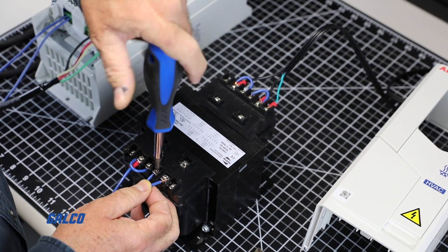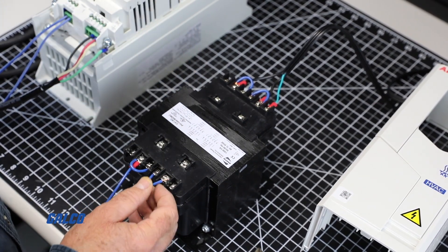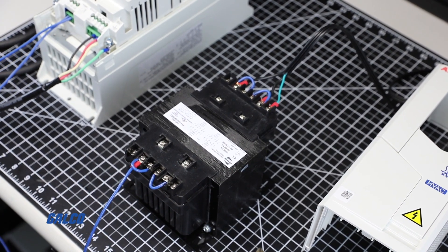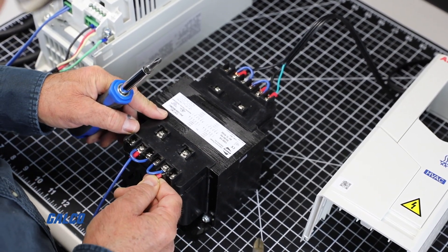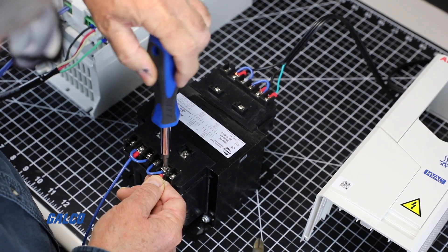The connection we will need is the 4 and 5 jumper and the 2 and 3 jumper with a line coming off of each one. We removed the line jumper in the middle that would have supplied the 480 volt power and properly reconfigured our connection so we can now safely energize the drive.